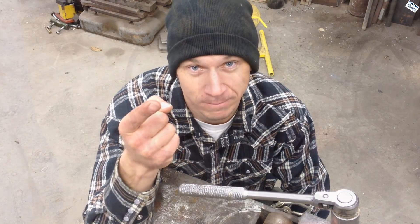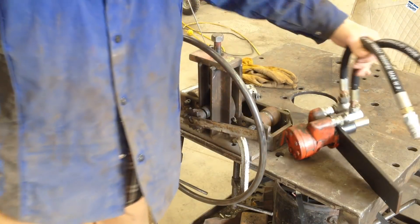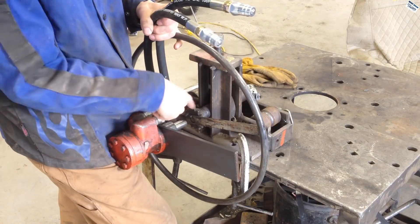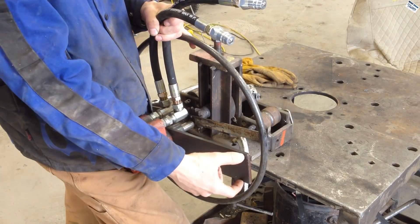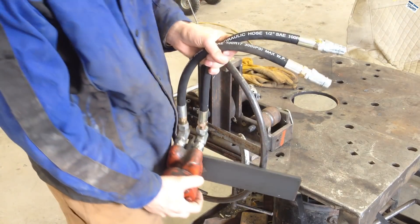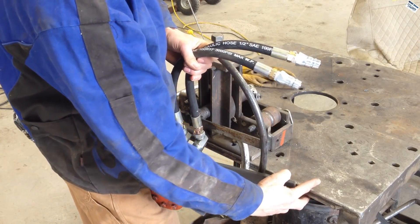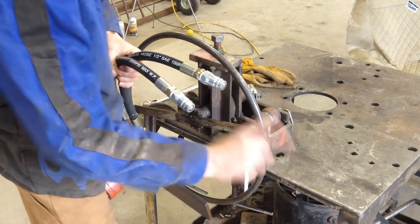That's a good idea. My thinking is to pull off this wheel, take my line boring motor, stick it on there. I have to make a coupler apparently. And then I think I might just stick a rod or two bolts or something through this to where it can pin or slide, fork over the edge of this table here, so it can still have some play for adjusting up and down, but it won't spin around.